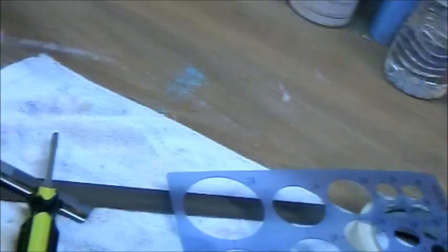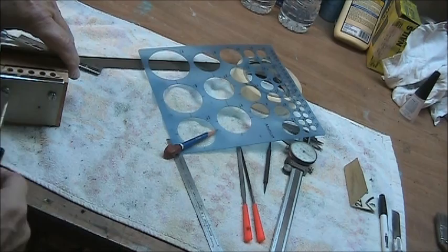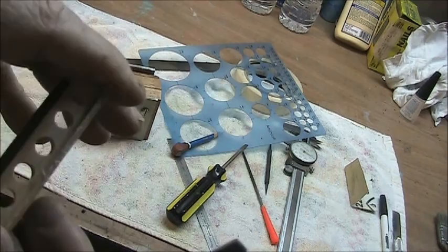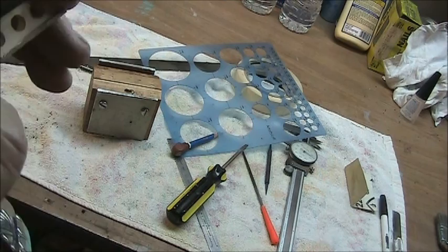I've got a little feather edge right there, so I want to bring it back to the bench to finish the bridge — almost done. Now I take it out of the jig and do some handwork. Not a lot, just a little. I need to cut the string slots. There's the bridge. I'm going to take the little flat file — see that little feather of wood right there on the edge of the foot? I just relieve that slightly, just enough to remove that feather. I don't really see one on this side, but I'll give it just a slight little rub.